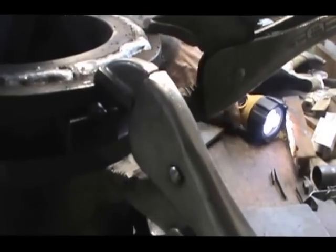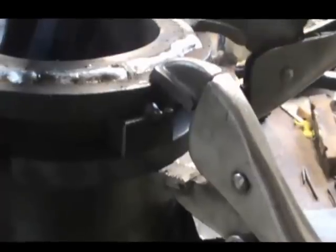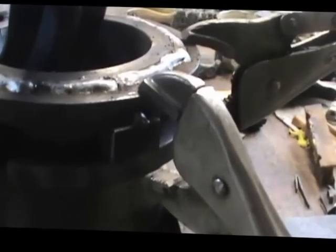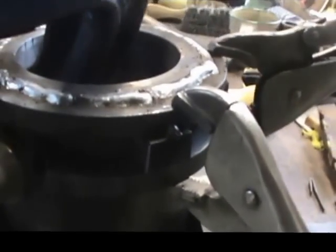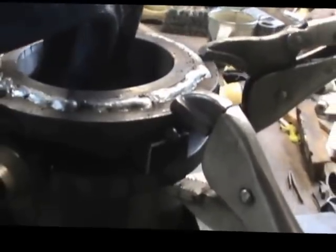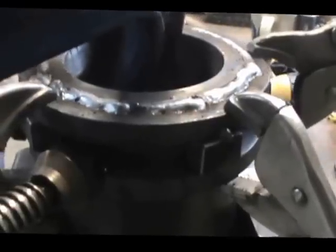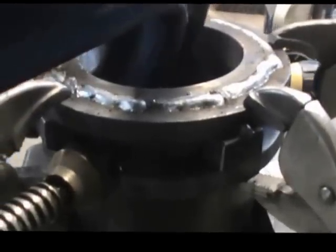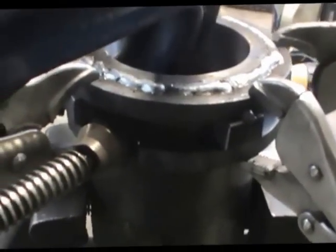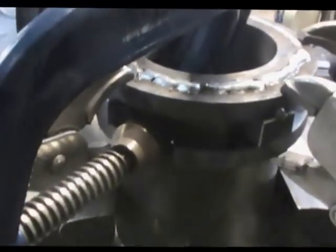And our clutch collar is 3/4 of an inch, so Byron will mill this down, giving us a few thousandths clearance for that clutch collar to spin in there, because this piece we're looking at right now is not spinning. That piece is stationary, and that's what pushes back and forth on the clutch, pushing the friction plate into the wooden blocks on the spider. So we're going to take this outside and do some tack welds and weld that last band on solid. And we'll see what it looks like in a minute.